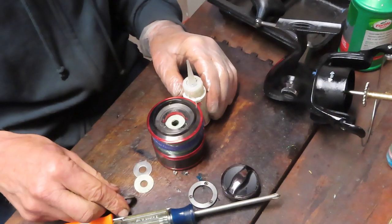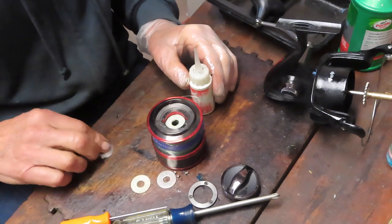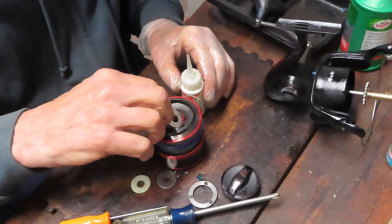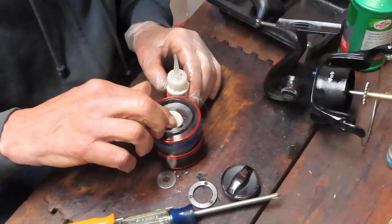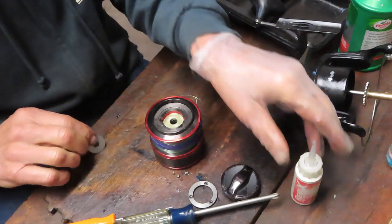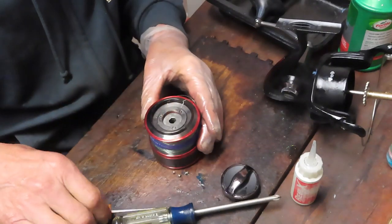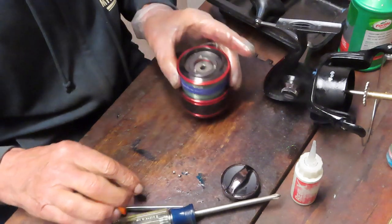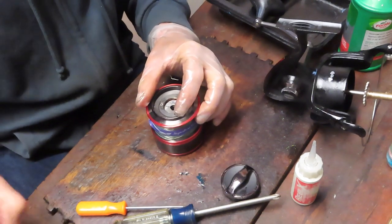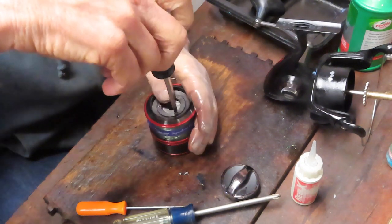We're doing a stack — this has got five washers in it, alternating between keyed washers and eared washers. The keyed washer is first, and we've done several now. It's time for the second keyed washer, then the last felt washer. We've oiled each one with a pretty liberal dose of oil. Now we can go back in with the cap — line that cap to the holes. The three screws are on the desk. We'll get that back on, button this up, and make sure it's working.